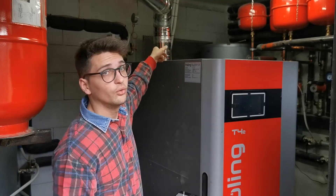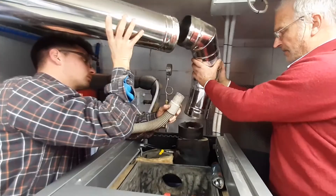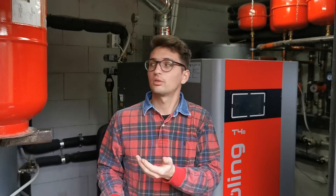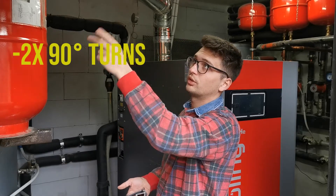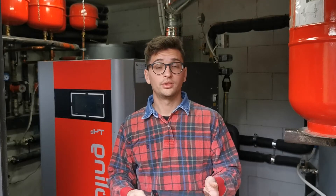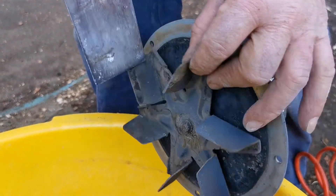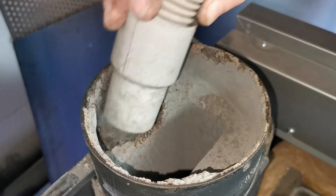Finally, we have to clean the flue lines and the main fume blower. We start by removing the first flue line turn, then move to the horizontal line — there are a lot of residuals on it because flying ashes fall down easily in horizontal sections. The ideal flue line is perfectly vertical, but due to the plant design we had to add two 90-degree turns and a horizontal section. Then we dismount the blower at the back of the boiler, remove the external protection and the motor, and clean the dirty blades full of fine ashes manually and with compressed air.